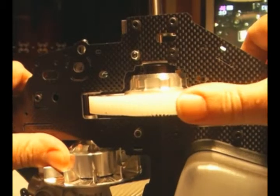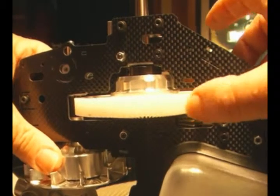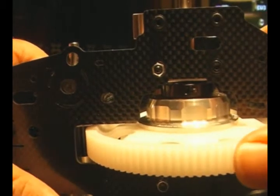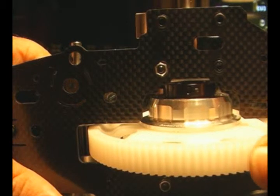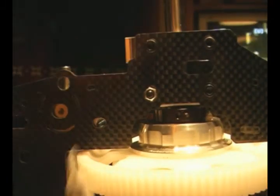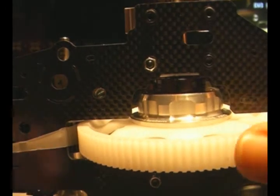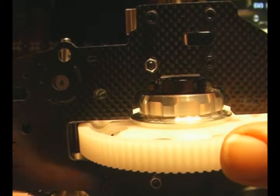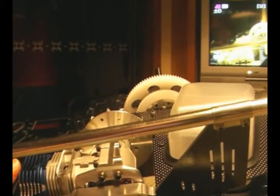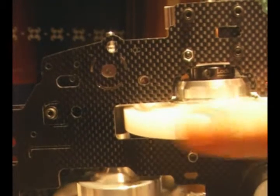And then you can hold the clutch steady and you can rock the pinion gear until you get your desired amount of backlash. If you listen now, that's the minimum amount of backlash, and that turns really well on the pinion. That's our 0.3 to 0.5 millimeters again. That's probably a little bit much, so I might just sneak that in a bit. Or the time-honoured way is to get a strip of plastic and put that down between the pinion gear and the main gear, and then just tighten up, and there shouldn't be any backlash with the plastic in, but there should be a minimal amount with it out. And once you're satisfied with that, do up again the 4 bottom mounting plate bolts, 2 on each side. Once you've got that right, you'll find the engine and flywheel turning over nice and smoothly there.